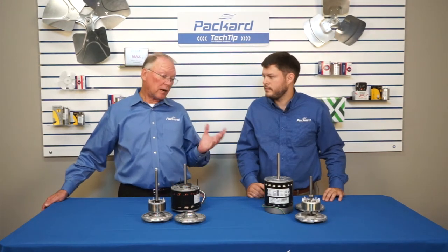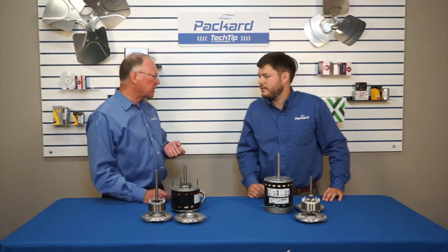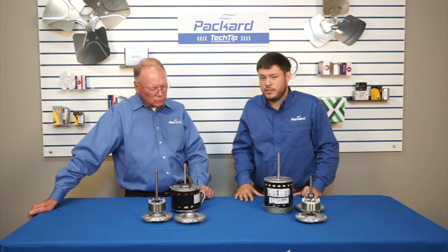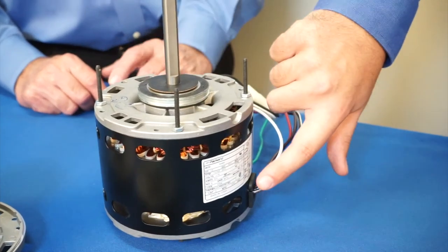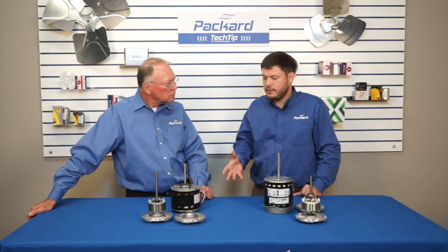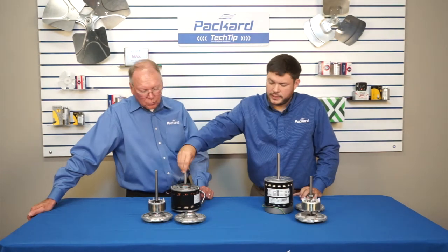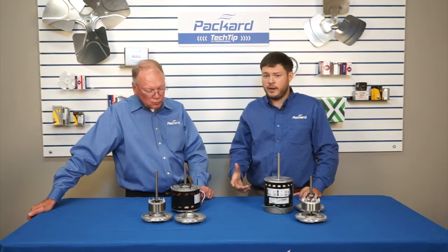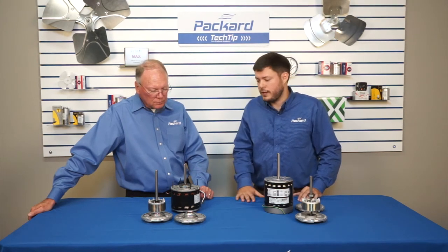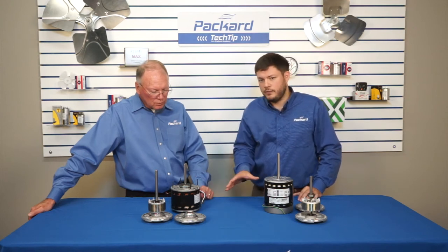What can cause these things to fail? I hear this all the time — a guy will call and say, why is it that sometimes I get a brand new motor, take it out of the box, and the shaft won't even turn? That's a very common problem. If you inspect that motor for damage — dropped during shipping, bounced around — a lot of times that damage will show up as indents in the motor housing, in the end plate, or bent studs. A sleeve bearing can become misaligned during shipping, and a lot of times that shaft will be a little tight fresh out of the box. A sleeve bearing, because of its construction, does have the opportunity to loosen back up if it's not truly damaged — if it's just misaligned. You can occasionally loosen the end plates and realign it. Always be sure to tighten all of your mounting bolts back down afterwards.